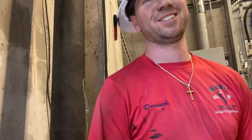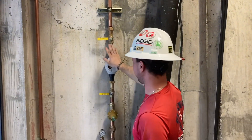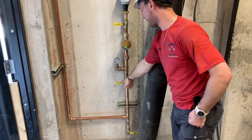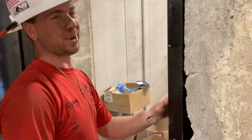Are we rolling? You are dirty — it's a tough day. We got the bulk of the work done. Our three-quarter K and our one-inch K into the building — I believe this is the sprinkler main. One-inch K, and then we come down. First shutoff: water meter. Second shutoff: pressure reducing valve, our gauge. Third shutoff: our drain and blow-down port. Then we go up, over. We had to do a little workaround going through there — I tried to drill a hole but this is some serious structure; it'll last hundreds of generations.